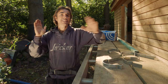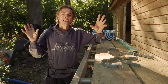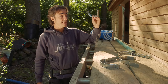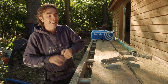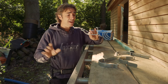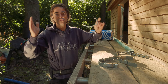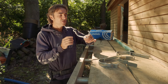On the other elevation it's 10 metres long, and I'm going to do that all in one go — roughly nine lengths, which is about 35mm of drop. I've got a fascia board which is around 200mm, so I've got plenty of scope using the heavy-duty bracket, which is really heavy duty — you're not going to bend that. I talked about the leaves and the weight; I've got no worries about that. The brackets are spaced at 800mm centres. If you do plastic guttering, you're used to putting them at three feet or 900mm, so these are a little bit closer together — a real belt and braces job.